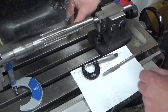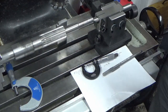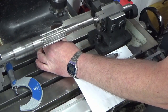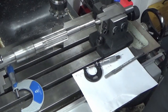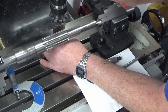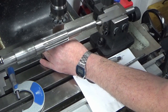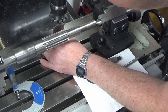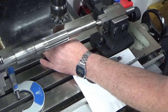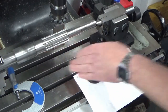until I get a feel on top of that slip pile on the underside of the cutter. So that's the next job. I think you should be able to see the cutter come into view very shortly. I've got my DRO switched on. Just put that over a bit so I can get the slips onto the plain portion of the bed. Just going to gently lock up my head. So I've just got a feel there on the slips.